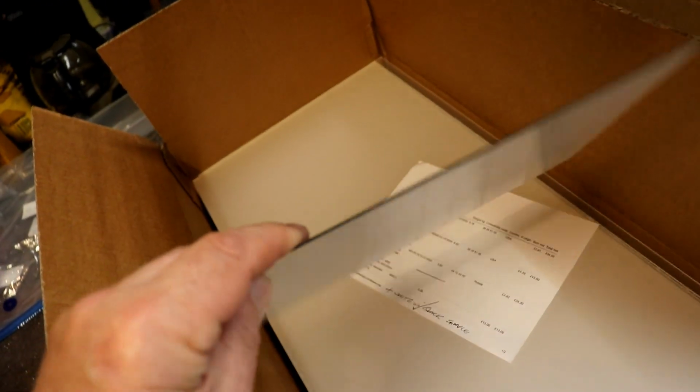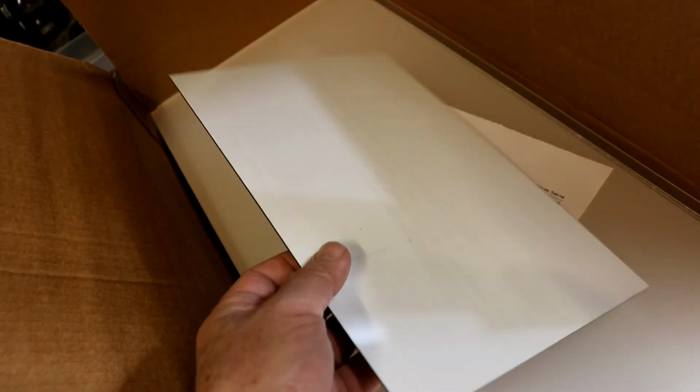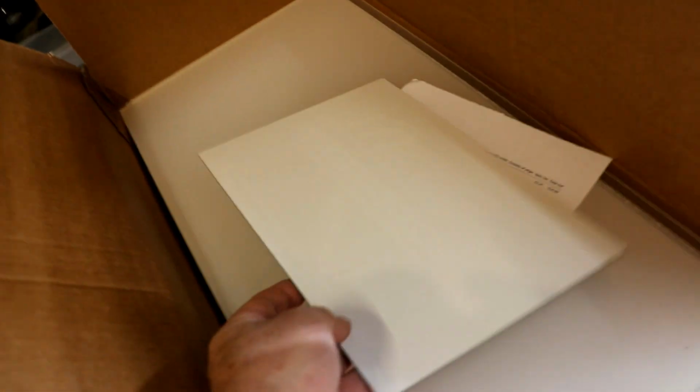That's incredible. And I even requested a piece because I found they did engraving laminate, and I'm always looking to see if they're a better value supplier. But sometimes if you get cheap engraving laminate, it's awful. It doesn't cut, it's really sooty, it stinks, and you end up basically having to wipe away all the engravings trying to get all the soot off. So they very kindly sent me the sample as well. I'm very impressed, I have to say. So I can get on with the laser cutting.